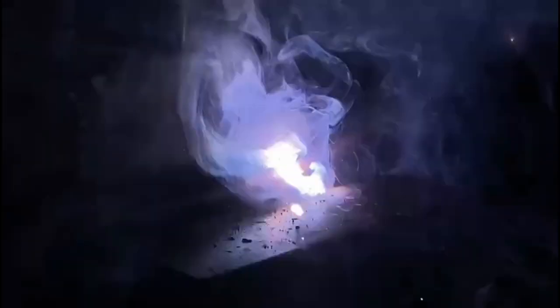To ensure that we fuse into the top of the plate and the previous run, we have to ensure that we allow our weld metal to build up consistently throughout by maintaining the same speed. You can do this by keeping an eye on your leg lengths all the way down your joint. This is where you're going to get that nice looking professional finish.